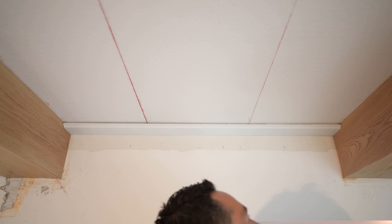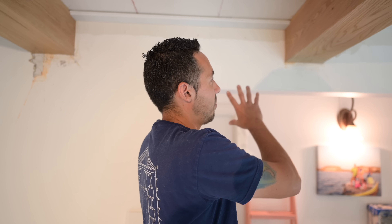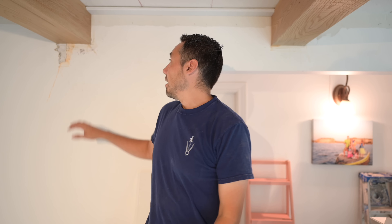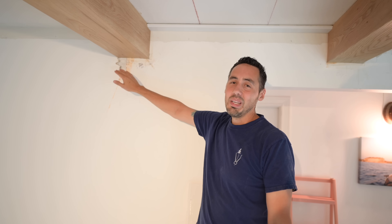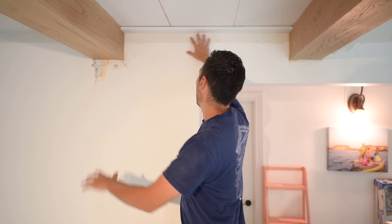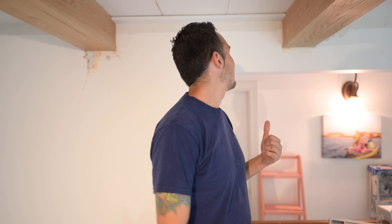Repeat the process and this piece should fit right in. That is freaking beautiful — we're tight here on both sides. If we were on a finished wall surface I probably would have back-beveled that rip to three inches. But I've got so much drywall work to do to these walls — we tried to do the pinch fit on the beams and we pinched one way too hard and damaged it really bad.